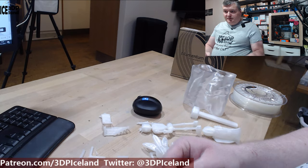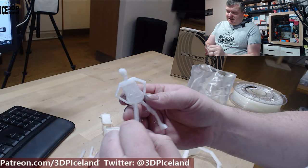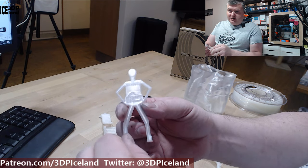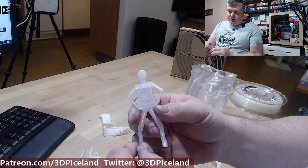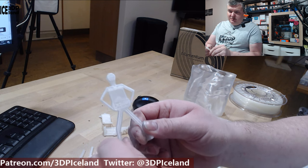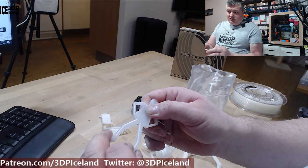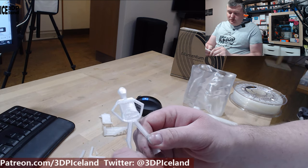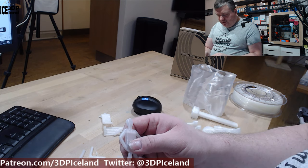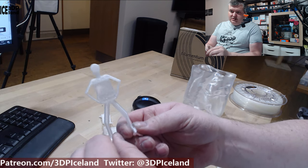I then did the Mr. Belly model. This one I printed a little bit too fast — as you can see it didn't have time to cool down. I reprinted it a little bit slower and with a little bit of part cooling, and then it came out pretty nice and quite tough. It's okay to have a little bit of fan, but normally you don't want too much fan — if you use too much fan on nylon it may cause bad layer adhesion.